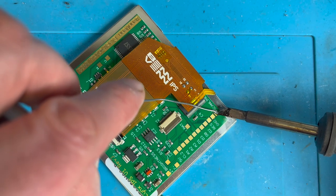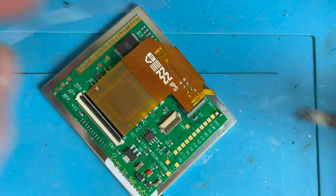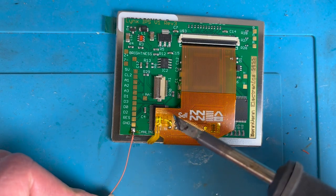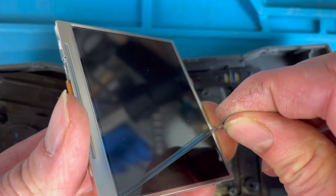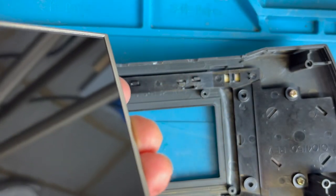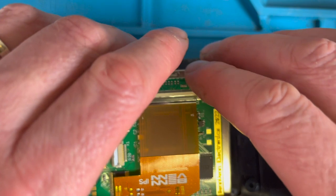This is truly plug and play, but you do have the additional option of toggling on some scan lines. In order to do that you need to solder a wire to the bottom pad where it says 'scan lines', and then when you drop in the screen, solder the other end of the wire to one of the pins.